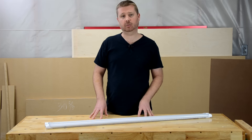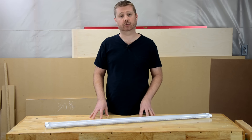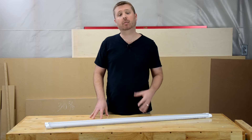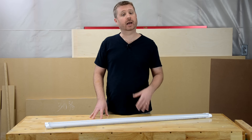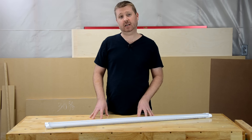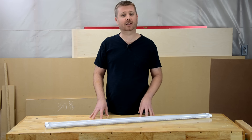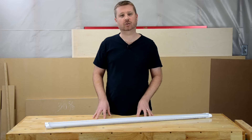The second feature of LED bulbs you want to look for is whether or not they require a ballast. Some do, some don't, and some give you the option of using a ballast or not. Personally, I recommend removing or bypassing your ballast, because ballasts fail. I've replaced five ballasts in the last three years, and quite frankly, I'm tired of doing that. If you remove it or bypass it, you'll save yourself a future repair that really doesn't serve much purpose.